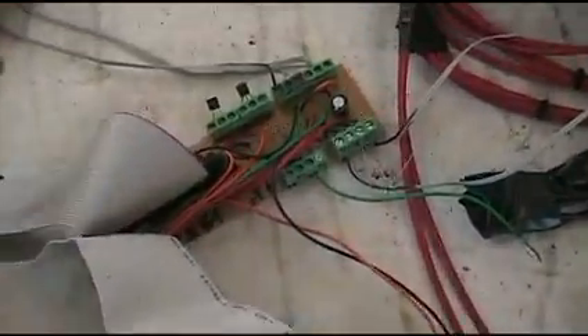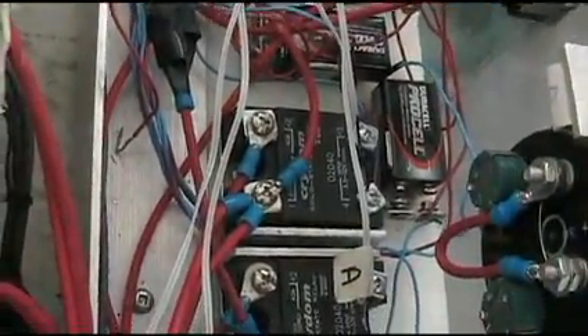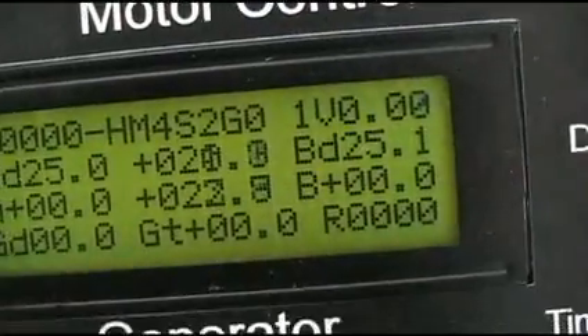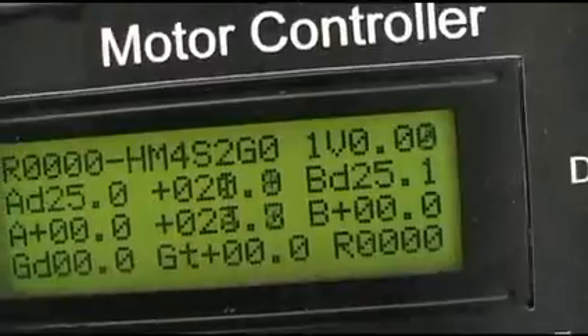You can see the whole thing here — there's an input and then an output. The output goes to the SCRs which control the power to the motor. The temperature sensor is sitting at 20°C right now. With my finger on it, it reads 23 degrees — I can put that sensor anywhere I want.